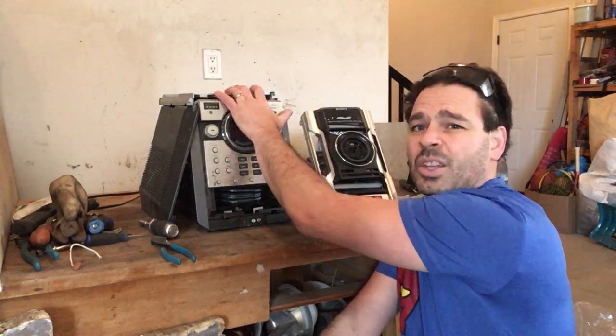Any types of speakers and other items, the scrapyard will pay you by weight. Electronic weight price is about 5 to 6 cents a pound in Sarnia, Ontario, in Canadian funds. So that is definitely a good thing. This one actually weighs 26 pounds as is. However, you definitely want to make sure you open it — given the weight, you know you're going to make more money from the scrap by separating the items. With having a large transformer in here, those transformers are going to have number 2 copper inside of them. And number 2 copper is right now going for about $4.43 a pound.